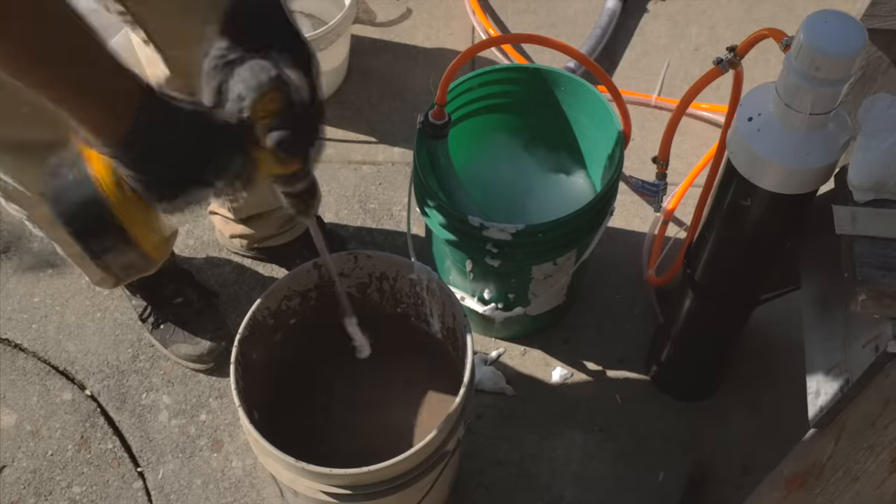These panels were submerged in water in an improvised tank that was a recycled bathtub. They soaked for two weeks, then were pulled out and allowed to slowly dry in my shop for another two weeks. Then I weighed the panels and lined the first two I cast on the lawn and ran a line trimmer against them as a test of durability. I wanted to see how this denser aircrete held up to the impact of the spinning line, and I wanted to see if the perlite helped.